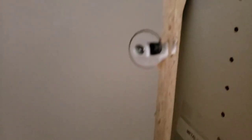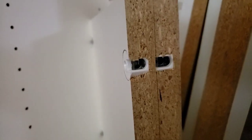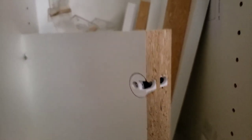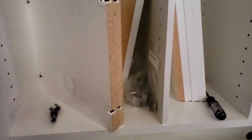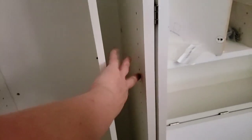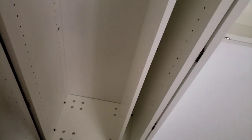There's a cam inside that turns and locks itself down over the little screw head. I have never seen a cam like this before where it's pre-installed into the wood — you don't have to drop it in yourself. You basically just shove these into a hole, levelly obviously, rest the shelf on the hooks, then reach from underneath and screw in at a 45-degree angle until you feel the mechanism turn and lock over the connecting bolt. They do have some pretty fancy proprietary pieces that are what makes this so expensive — it comes down to the manufacturing.